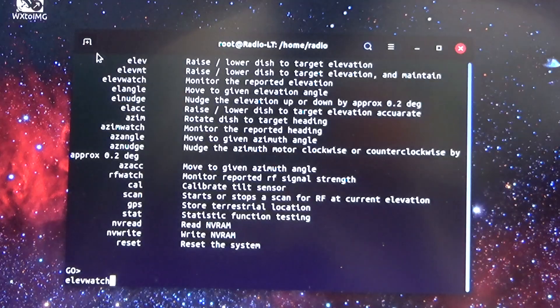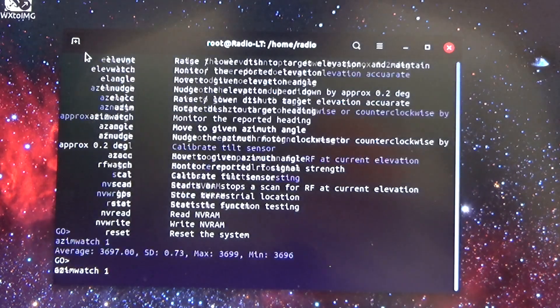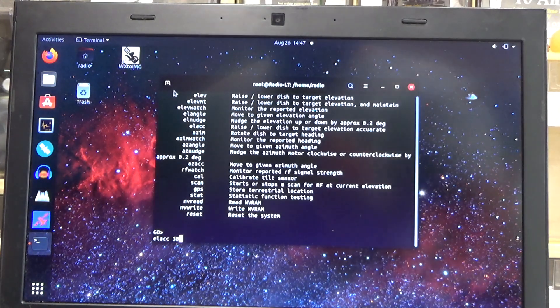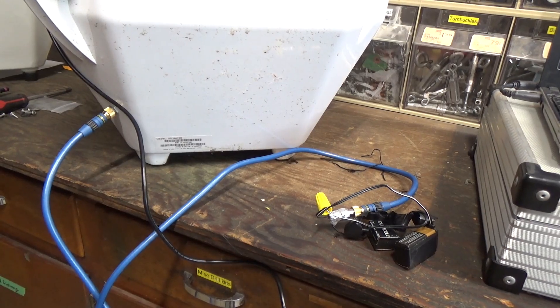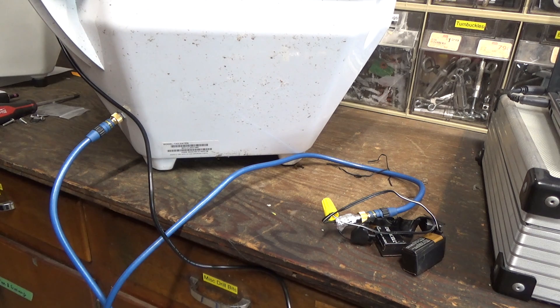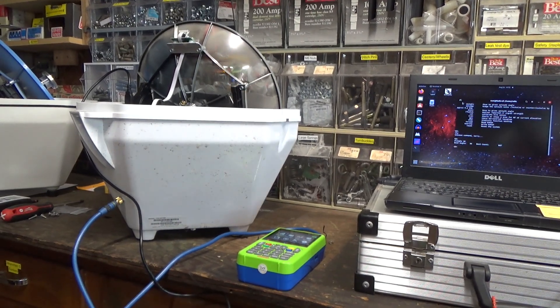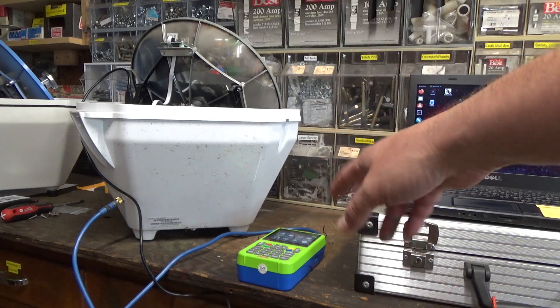Since the battery is dead on my little meter, I'm just powering this dish off of two 9-volt batteries hacked into the cable. Let's see what other info we can get out of the dish brain. I'm still not sure of the difference between elevation, L-angle, and L-accurate — it seems to have different measurements for positions. Let's try L-acc, elevation accurate, for 30. Crashed again. It's possible I'm just running out of power when I try to run the motors. With the meter powering the dish and trying L-angle 30, it seems to be coming up to 30-degree angle — that's what I expected. We definitely weren't getting enough power out of those 9-volt batteries.